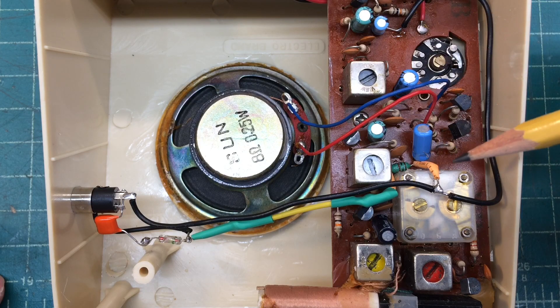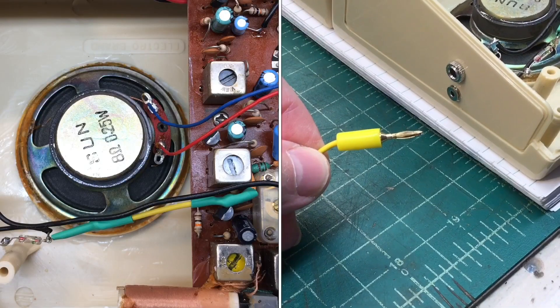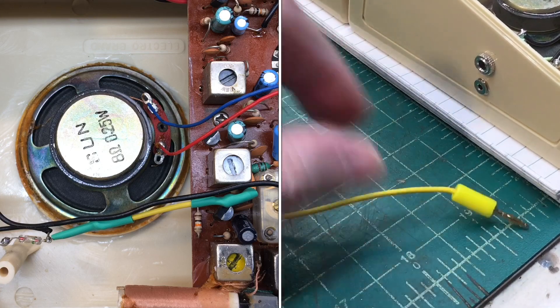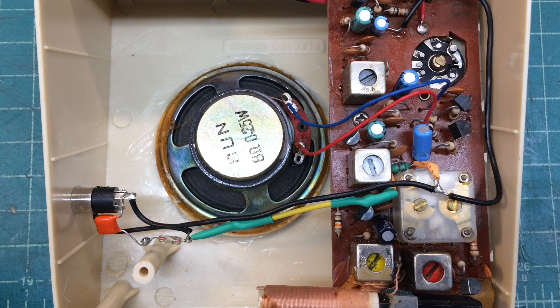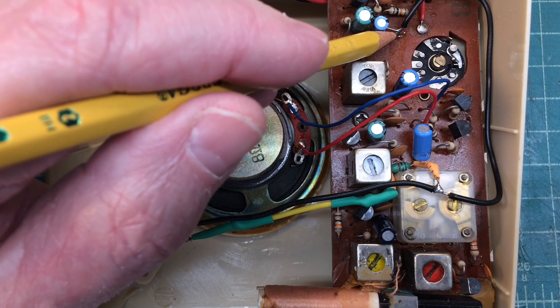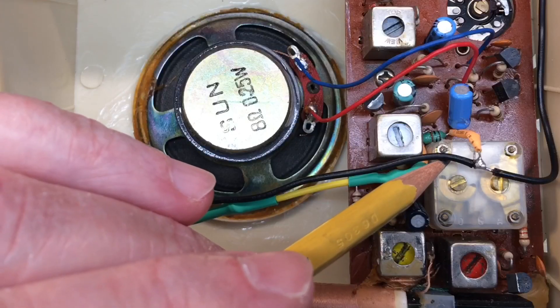It's that simple a circuit. The diode allows me to modulate the carrier — it's not a perfect modulation scheme, but it's practical and useful. The antenna output uses a 2mm banana female plug, with about 2 to 3 feet of wire in close proximity to the loop antenna of the receiver. The only connection point to the actual circuit is the ground, since we're picking up the local oscillator through induction.